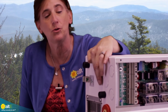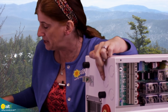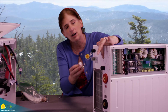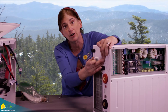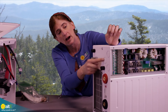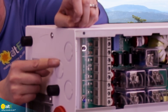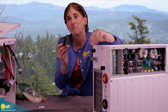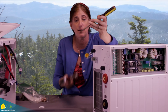The first thing you need to do is knock out one of these pre-punched knockout holes. The mini PDP comes with a couple of these nice gaskets, so when we knock this out it's going to fit in here nicely to add a protective barrier for the wires. This is where our AC wires are going to go in. There are three holes here — I like just punching out the one that's by itself, and you knock out the outer ring. The best way to do it is with a flat head screwdriver and a hammer.